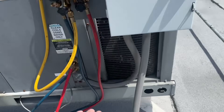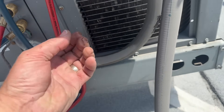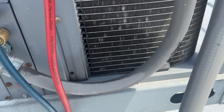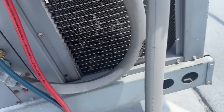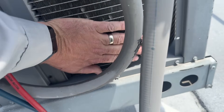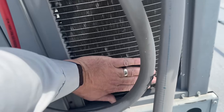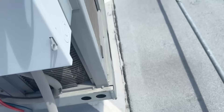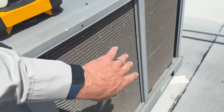We're looking at a very darkish spot there — some oil residue. I wouldn't be shocked if we have a leak right there. And it feels cold there too, by the way — that area is cold. The bottom of the coil is cold, the top is hot.